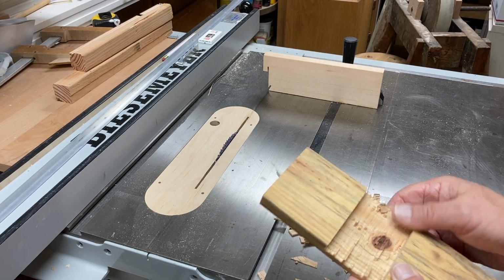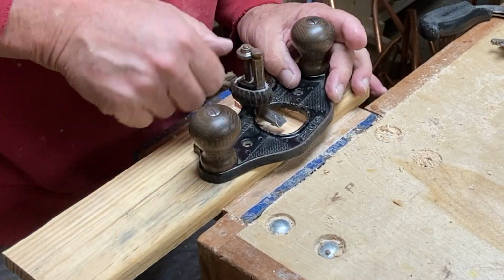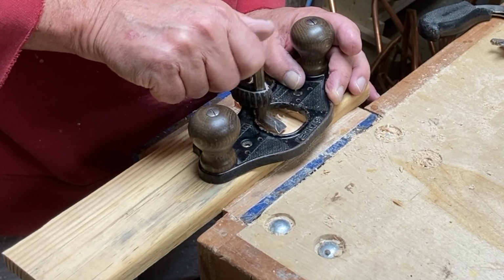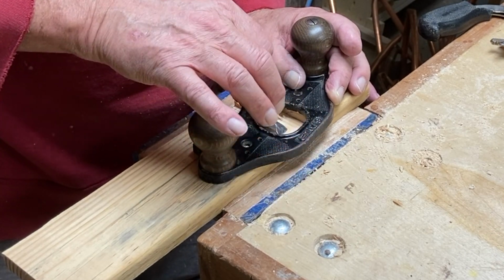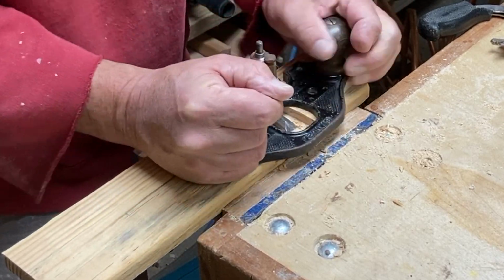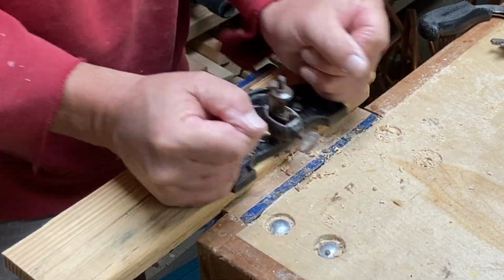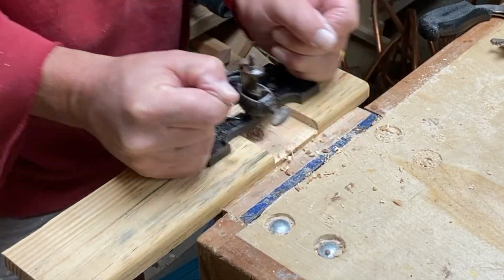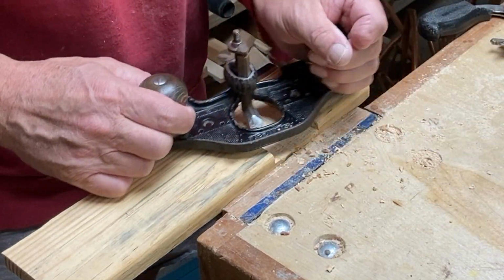And you'll see once you get that scrape clear with your fingers, you just adjust that plane blade to the flat surface, and you can find a spot there in your cutting area that's flat down to the surface. Tighten that up and plane away. It takes off those little ridges. It takes them off very level. The plane holds the blade to the exact depth of your dado, and you can see how quickly it cleans up. It really cleans up very quickly.